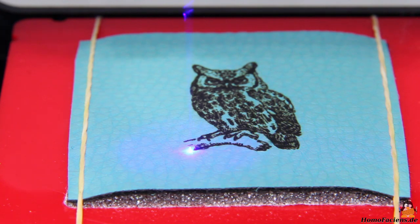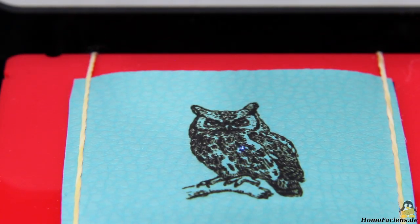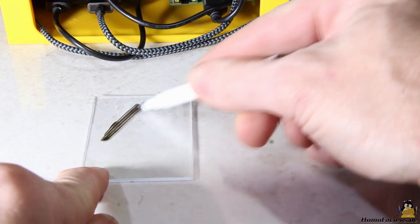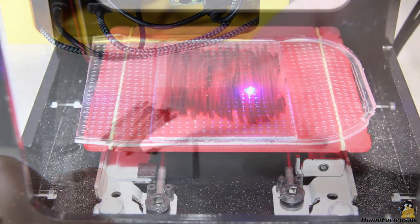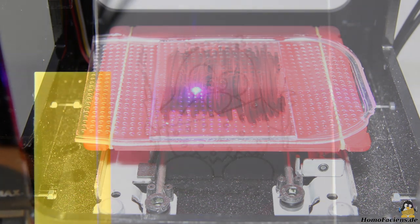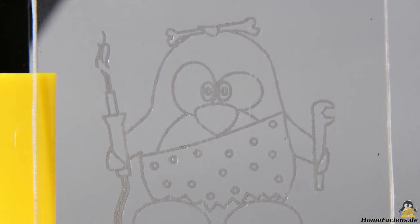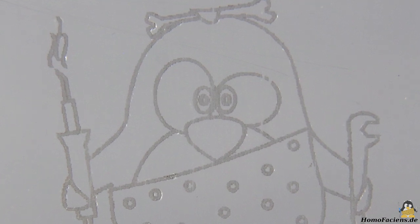Most materials that are flammable can be engraved, which is true for leather or, as shown here, synthetic leather. When engraving the surface of a transparent plastic, it must be blackened beforehand with a pencil that ships with the machine; otherwise the laser light crosses the material without heating it up. With a burn time of 30ms at 70% laser power, clearly visible grooves are engraved on the surface. The result is not bad, but the surface was not covered evenly — huddling during preparation is punished by bad results, and areas not covered by black color show broken lines.